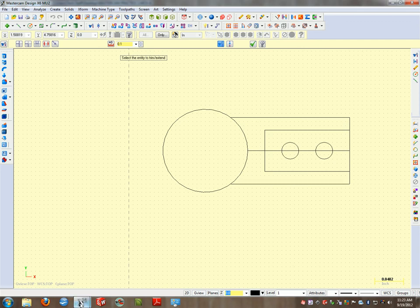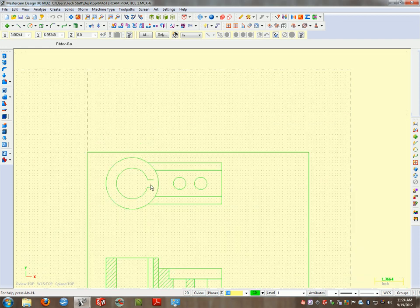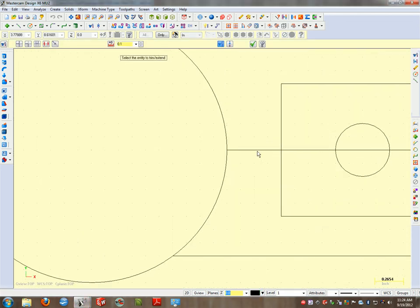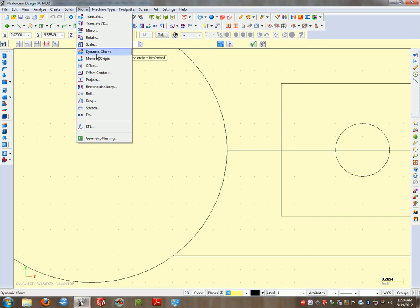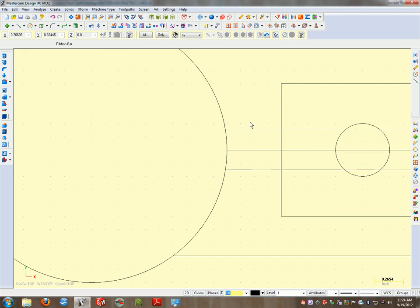The next challenging piece is this little keyway. How we create it depends on whether the dimensions are correct — if the dimensions are incorrect, you'll never be able to use that keyway. To create it, I'll use my center line. I know the total width of the keyway is 0.375 inches (three-eighths). I'll go to X-form Offset and offset 0.375 divided by 2, since I'm splitting it in both directions. That brings the line off 0.1875 in each direction, making the total width three-eighths or 0.375.